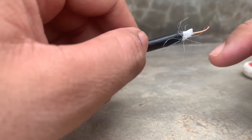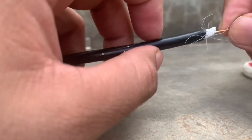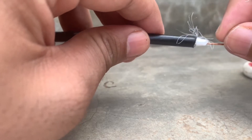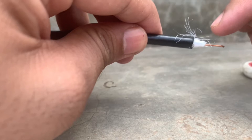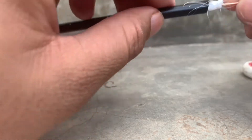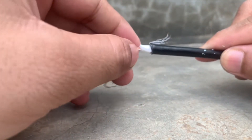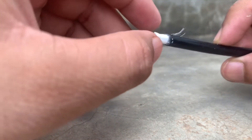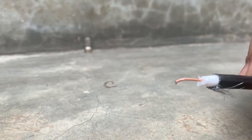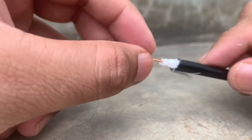What happens normally is if any of these tiny silver wires touch the main gold wire, your TV will not work — you will have bad reception or it may say it's out of service. There are many of these tiny wires, and if even a single one touches the main center conductor, the gold wire, you will not have a good reception. You need to make sure all of them are folded all the way back, neatly, with not even a single tiny silver wire touching the main center conductor.